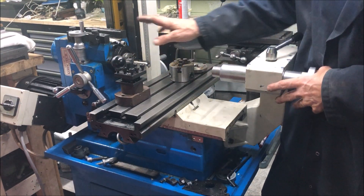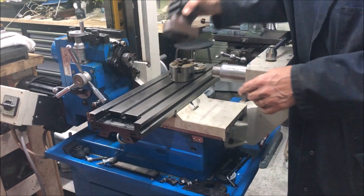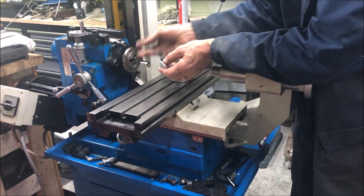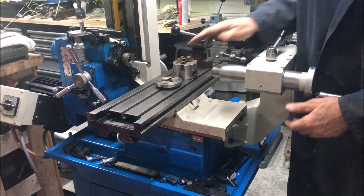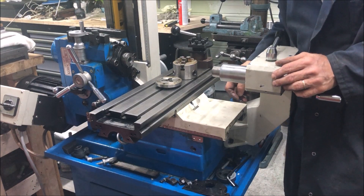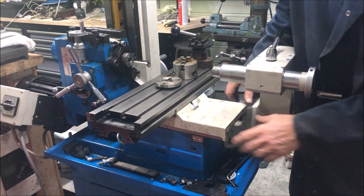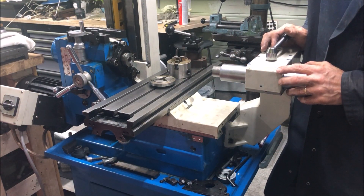What can be useful, though, is raising the head so you can swing larger diameters. And it has a special chuck plate design — just on here with the three screws, and the chuck on there again. But this needs a much better alignment than what the Chinese has done there. They've done a lousy job of copying the Golmatic here. If I'll use some time on this, I think I'll have to figure out maybe to extend this a little bit further out — at least it's not accurate enough.